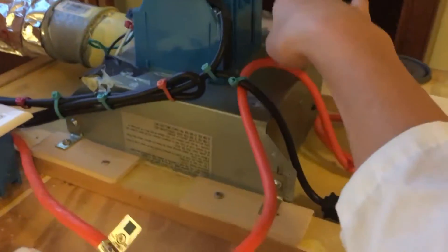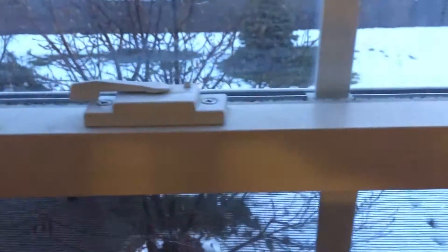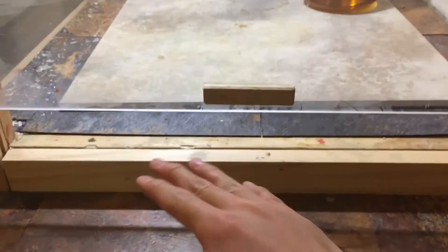Inside the fume hood, I have a plastic floor that looks like tile, and an actual tile I can throw out or clean so I don't have to take the whole fume hood apart. Up here I have a light — a very powerful LED that is touch-activated. I've used a bathroom fan for the actual exhaust; it's 25 cubic feet per minute. Normally I have a charcoal filter in here that absorbs harmful chemicals, and then I pipe it out here. The window is closed right now, but the pipe actually leads out and when the window is open it has a clear path outside. So whatever involves smoke or poisonous vapors, I lower the sash down so air is sucked from here up into the vent and out — there's always a negative pressure inside.